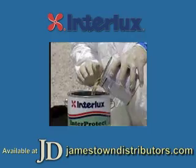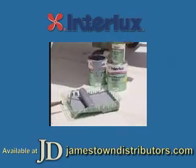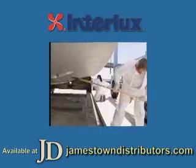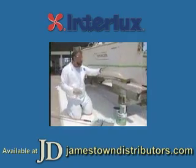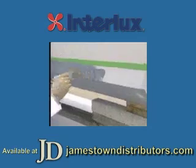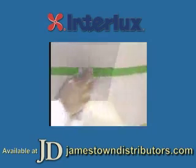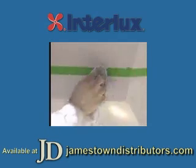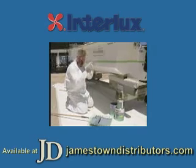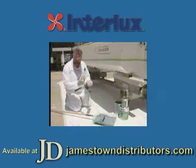We've gone ahead and mixed together the two-part formula for our epoxy barrier coat. Let me take you through the tools we're going to use to apply it. We have a paint insert along with a roller with an extension handle mounted on it. Notice that I'm wearing safety glasses as well as gloves - you do not want to touch any type of epoxy to your skin. I also want to talk about the tape line we've pulled. When applying the barrier coat and the anti-foulant paint, we want a nice defining edge. To get a clean line, take a rag and rub the tape back and forth - this is called burnishing the tape. The friction heats up the adhesive on the back side, giving you a good bond. This is a 3/8 inch nap roller - you want to use a 3/8 inch nap roller.